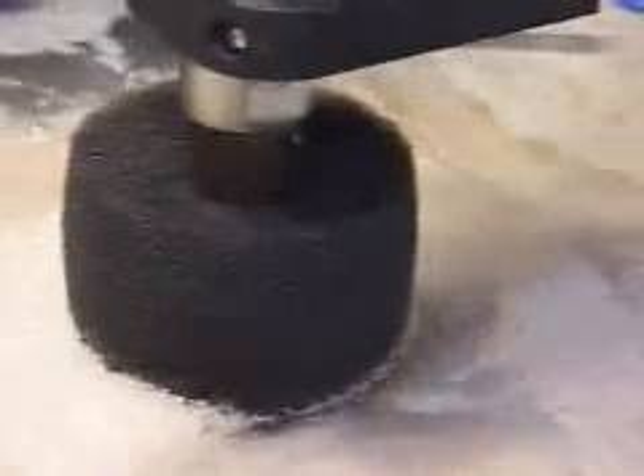What we're showing here is a part being cut. We just did our first rapid traverse move, and we're piercing the material here, raising the water level up there a little bit to avoid some of the splash and keep the noise down. That's a close-up of the nozzle there, with the little foam piece around it, just to keep the splash down.